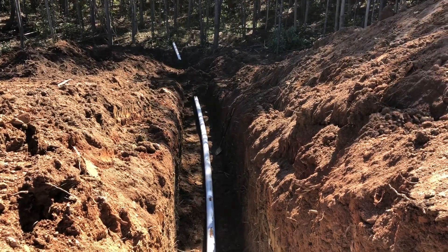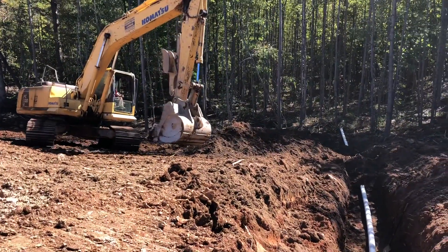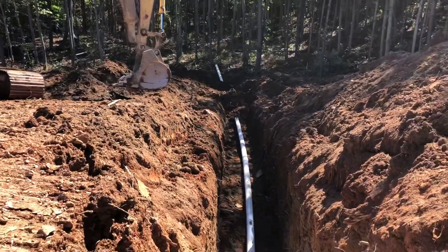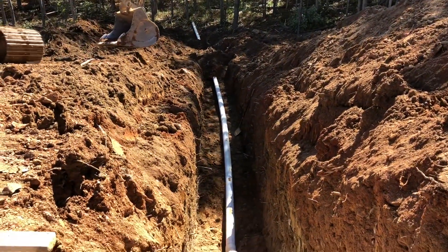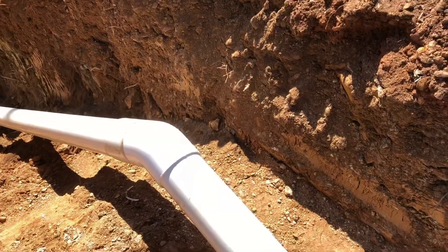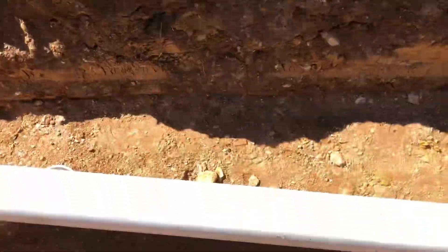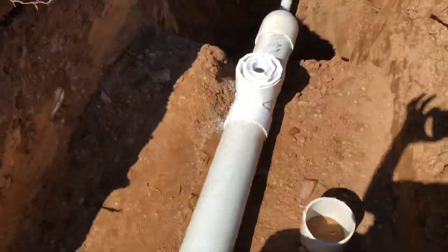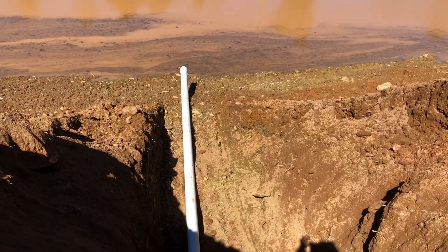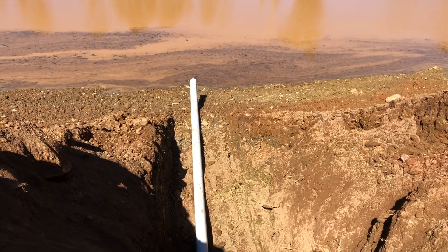We've got all of our pipe glued together. Nathan's back on the excavator — he leaves me over in the ditch doing all the work while he rides. The pipe comes in with four sticks glued together, comes to a 45, and goes back up to the top of the dam — well, where we dug down on the top of the dam. It comes back across with another 45, goes down to a 45, and then out. That section will actually be underwater eventually when the lake finishes filling up.